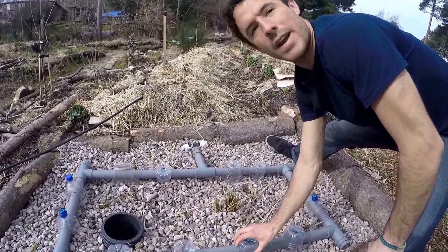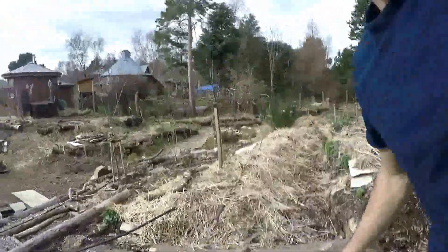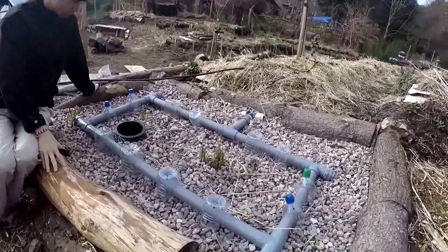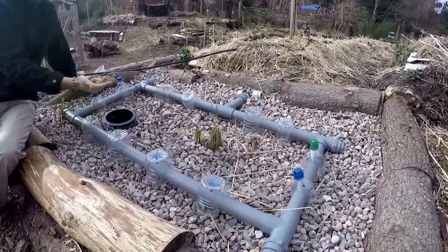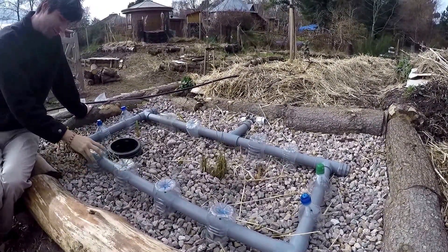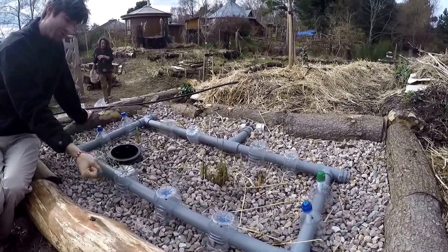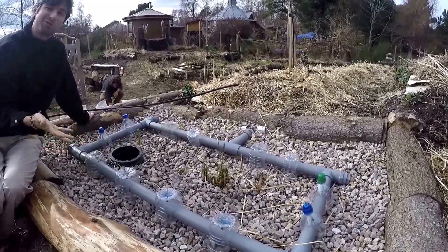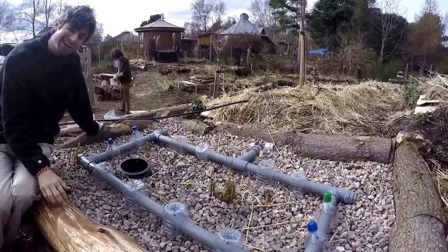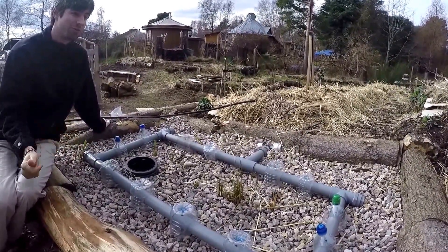These bottles are aerating the water. When water shoots up out of these small holes, it gets pushed around in these recycled aeration mixtures. The water gets mixed with air so that it becomes aerobic, so the bacteria that are doing the digesting of this water don't die. Instead, they serve their biological function, which is to purify the water.